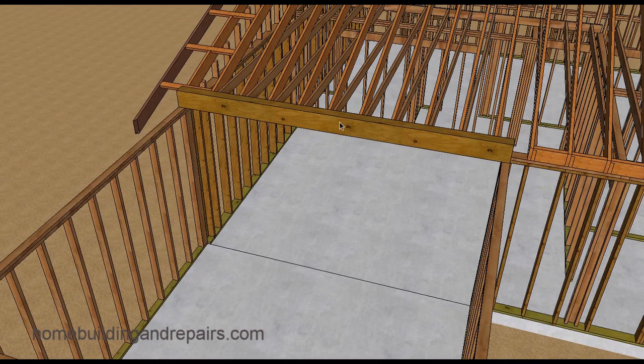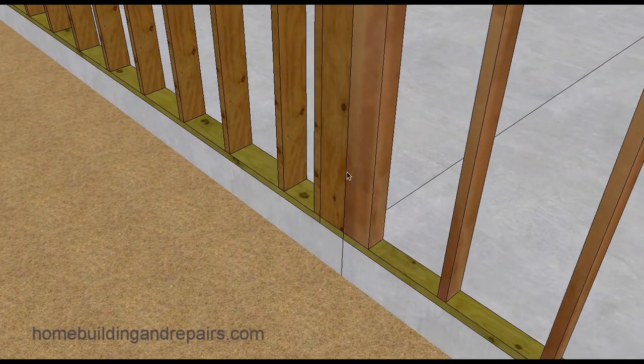Let's go ahead and install the beam here. You can see we have removed the wall — it's no longer there. The room addition's new slab would start here. A lot of times you're going to want to move the beam over into this area so that you can install any straps or hardware that might need to go in. You might actually need a hold down here. If it's further back, it might be difficult to install some of that. So if you can move it into the room addition area, it might be better and require less digging underneath the existing foundation.